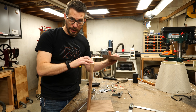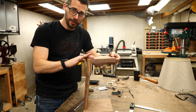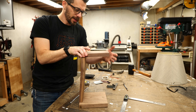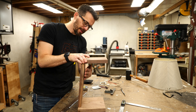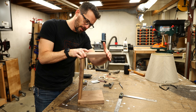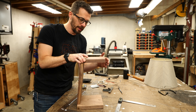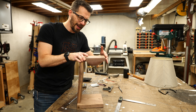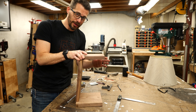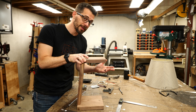So here's the plan as of right now. This is going to connect through some dowels so it's nice and strong, and we'll use dowels at the bottom to hold that as well. After putting this together, I realized I really like this slight angle, and I may want to mirror that angle on the bottom edges. So I think I'm going to set the table saw to the same seven-degree cut and add a chamfer to the edges. Unfortunately, if I don't like that, I've already cut off a lot of material, so we're going to see how it turns out.